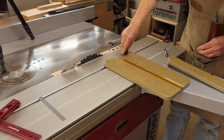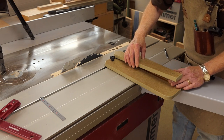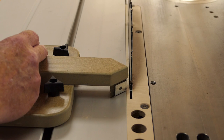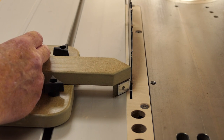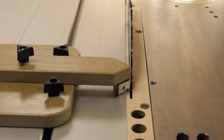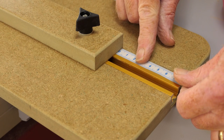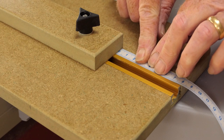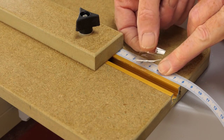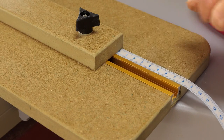Now to put it all together. To calibrate and set the scale in place, the stop bar is moved up so the angle bracket makes contact with one of the teeth, then locked in place. The liberated scale is slid up so that the zero mark is right on the back of the stop bar, held temporarily with a piece of sellotape so a test cut can be made to prove it's right.